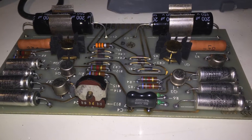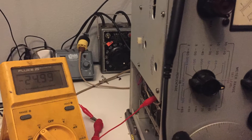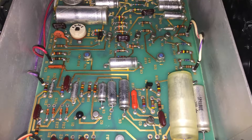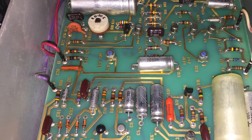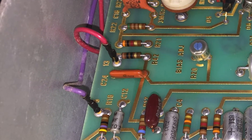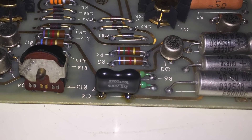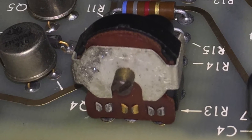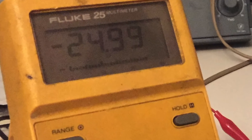Those capacitors were replaced, and I was able to receive the cable and plug in the unit to calibrate the power supply for negative 25 and positive 25 volts. I was then able to test the plus 25 and minus 25 volts coming off the power supply with a purple and red wire shown in the diagram. The potentiometer just off to the left sets up the negative 25 rail, which in turn powers the rest of the unit. The positive 25 is not adjustable.